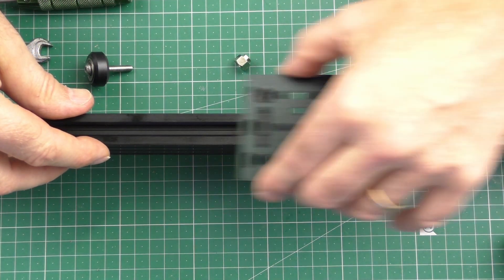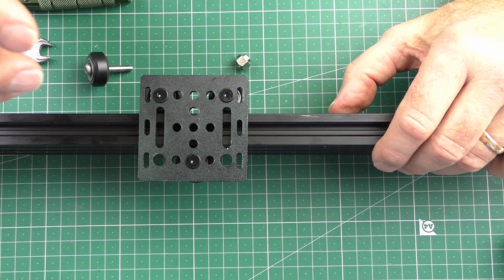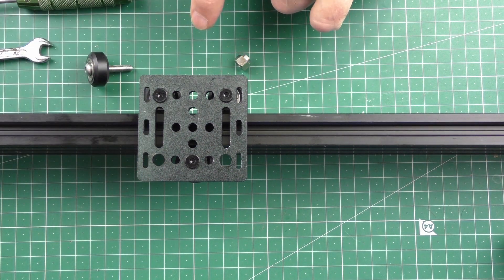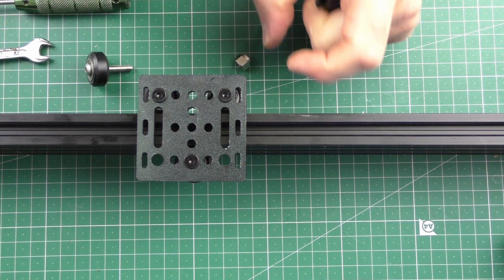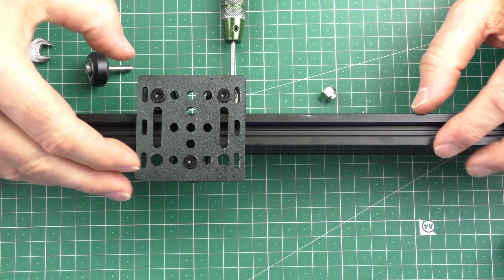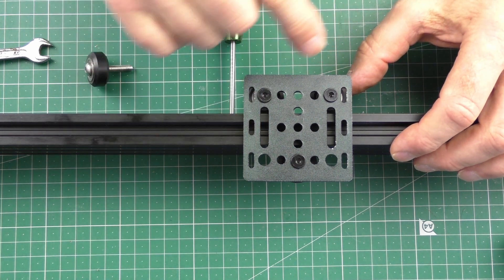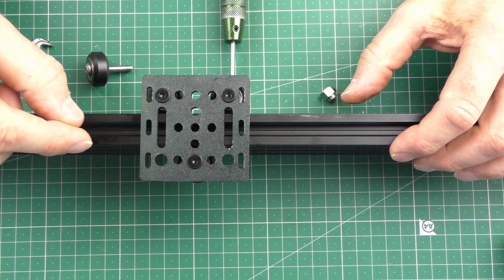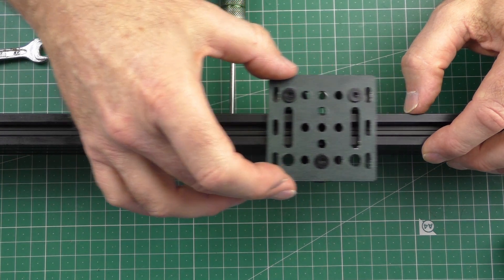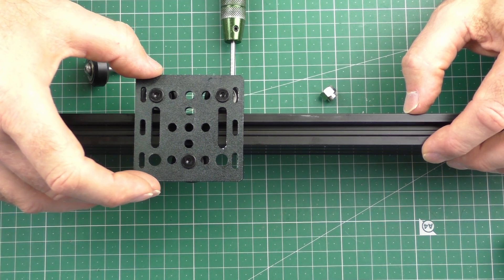An important point to note: before you start 3D printing each morning, with the power off just move your carriages. You only have to move it about 50 millimeters — that gives you one wheel rotation. So every time I start 3D printing I move all my carriages — which have wheels — about 100 millimeters one way and 100 millimeters back. Around the 50mm mark you shouldn't feel a clonk.